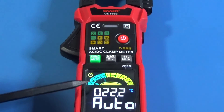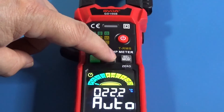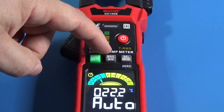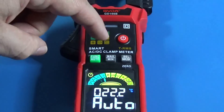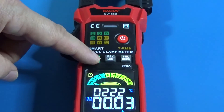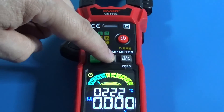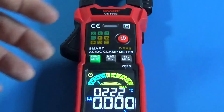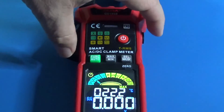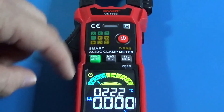You can also return to the smart auto mode. You can tell the device if you want to keep on the screen the maximum or minimum value, but you need to get it out of auto mode to enter that measurement. So now I can ask here if I want to hold the maximum voltage or the minimum voltage. Also if I am doing a measurement and I want to capture it, I can press the hold button. Pressing hold again releases it.